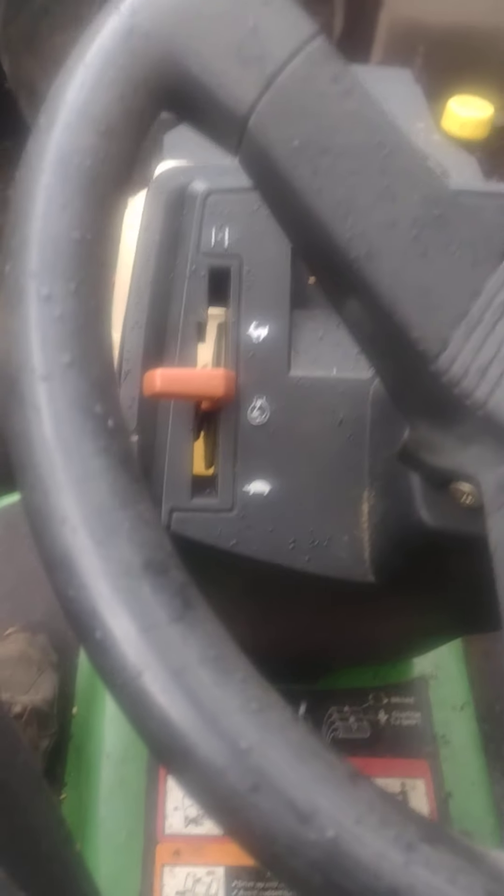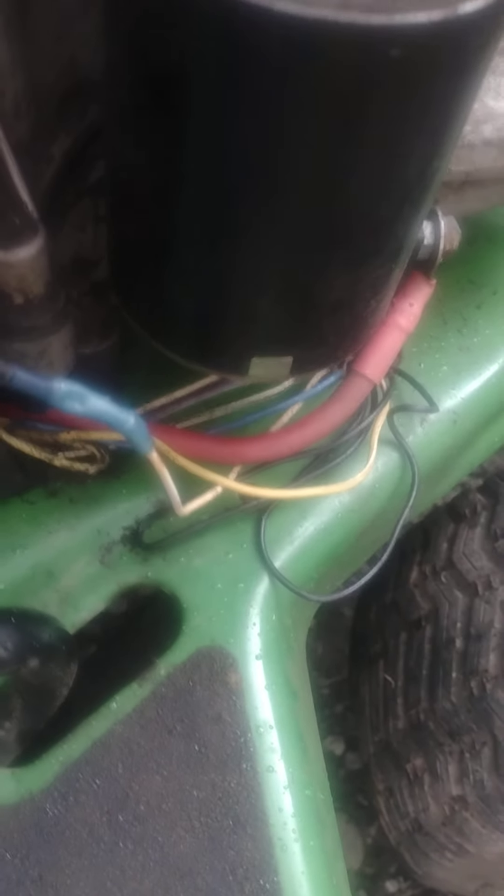I dug that out because this thing was kicking my butt. I couldn't figure out why it would run with the clutch in — or the brake, I guess they're calling that a brake-clutch — but as soon as you let that off it would die. The seat switch was jumped and it didn't matter. So I had to do a bunch of probing down here and using that logic probe I found the wire that changed state when I pushed the clutch in. That turned out to be a ground wire, and that ground wire comes over to this little thing that's all melted inside with wires all messed up.